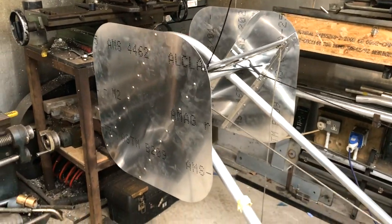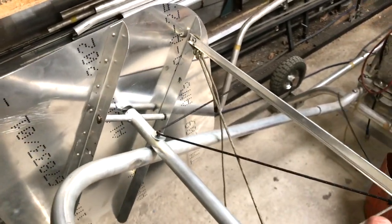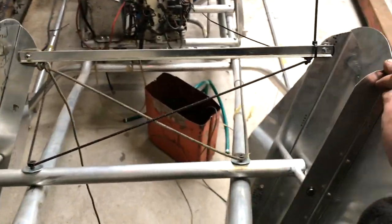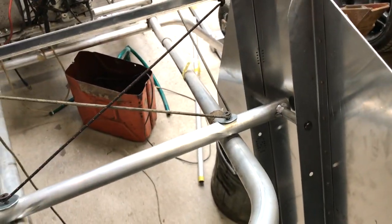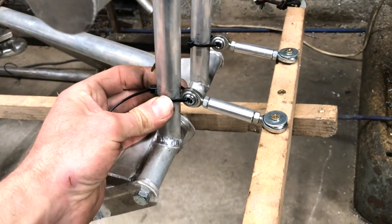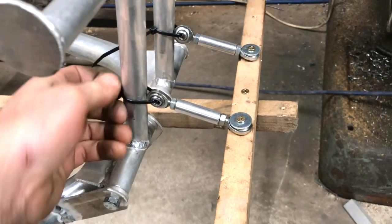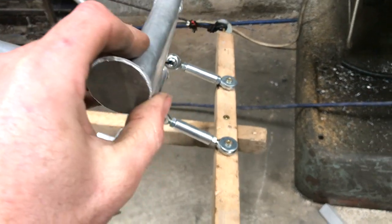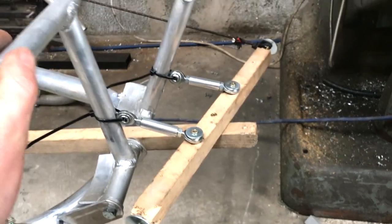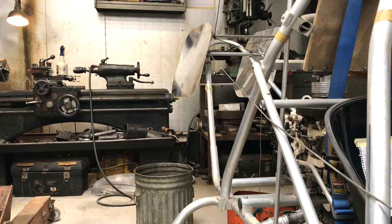The hinged vanes are flat 0.8mm aluminium with 0.5 square metres of total area. These are hinged at an angle to provide directional control in a hover and in forward flight, should I ever get to that stage. I'm going to need full travel for good rotational control. I haven't been able to establish what angle the vanes need to tilt, so like many of the design decisions it's a case of trial and error. Unfortunately the people who would know have either passed on or aren't easy to get hold of.